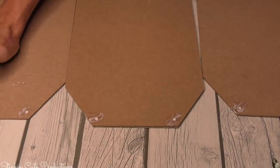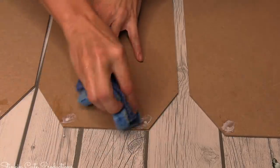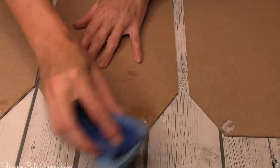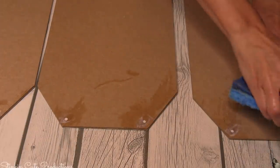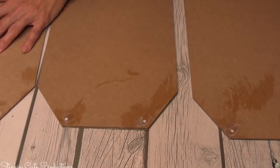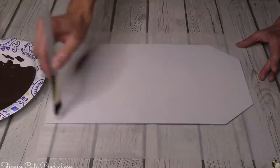Here's a quick trick that may save you some time: instead of using sandpaper when your spackling dries to sand off the excess, take a wet sponge or wet paper towel and wipe off the excess. Then you're good to go and ready to paint without waiting for it to dry.